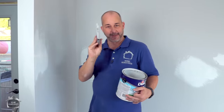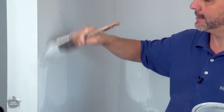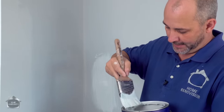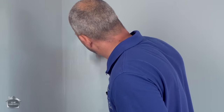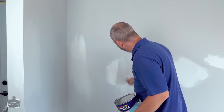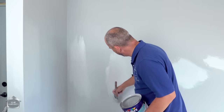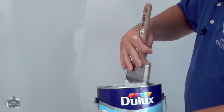I just finished doing all the cut line and my primer is dry. Now we're going to call this the first coat of color on the wall, and we're just going to brush over the primer — nice and light. We're not adding too much texture; don't want too many brush lines. Really feather it out — just want to add the color. What we're doing here is prepping for the second coat. This color covers incredibly well, so I don't have to be too careful, but depending on your paint you might want to use a mini roller to get good coverage, because the brush can leave little white streaks.